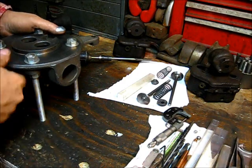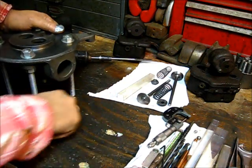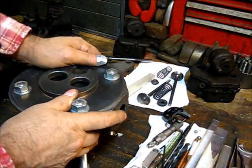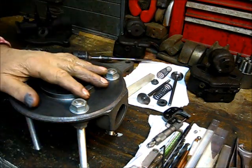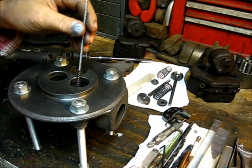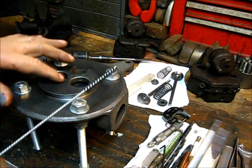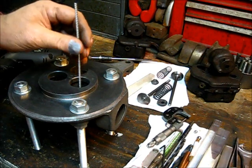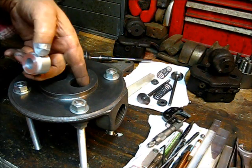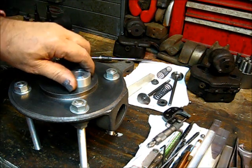This not being my normal work area, I drill four points in the workbench and the head stands off and fits in those points, so the head is secured — you want a secure workpiece. I did go through all these bores to clean out any rust or carbon with flex hones, which are invaluable when you need one. This bore right here is cleaned out really well; these have been in the electrolysis tank and cleaned very well.